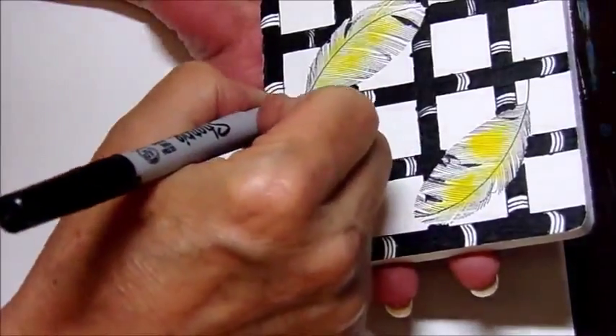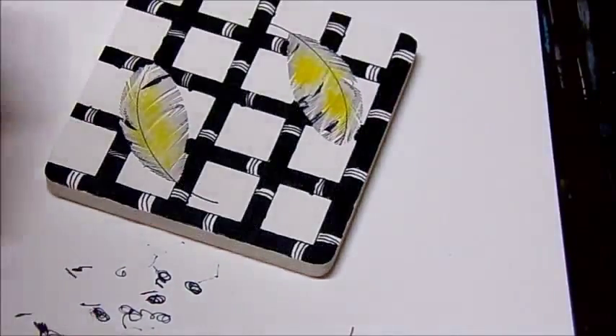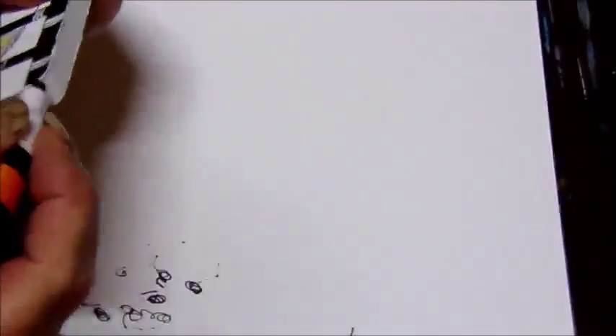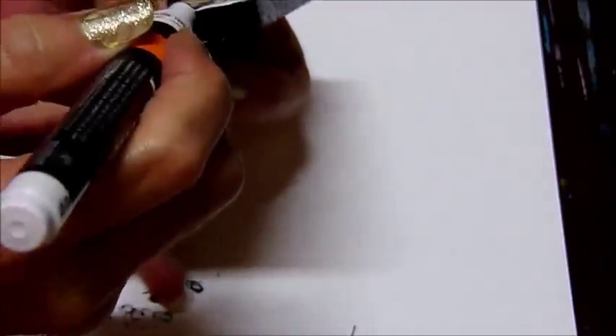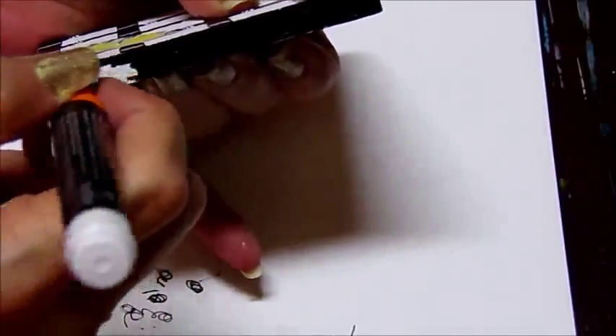Once you're finished and everything is dry, you're going to want to coat it with some type of urethane coating. I used a polycrylic that I purchased when I did Jenna's dresser with the chalk paint — it's pretty sturdy. I put three coats on them and they look really nice. On the bottom you can leave it blank, paint it, or put some cork or felt. I plan on putting felt on the bottom so it's quiet and won't scratch the table.